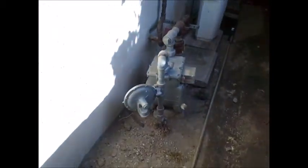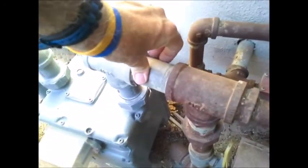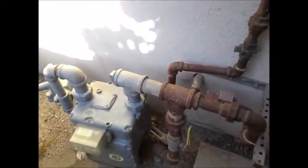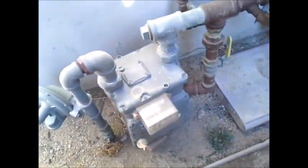Through the gate, on the right side of the house you have a decomposed granite walkway — very nice. And you've got a gas meter here. Notice off the side there's a seismic gas shutoff valve, but they put it in the wrong area. It should have been put up here because it doesn't control all your gas lines, so the retrofit company will probably flag that. Here you manually shut off the gas on this valve by turning it 90 degrees. When the handle is perpendicular to the pipe it's off, and you will need a wrench for it.